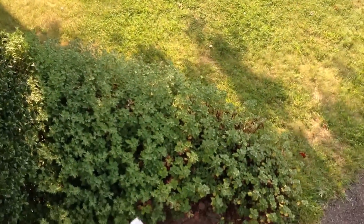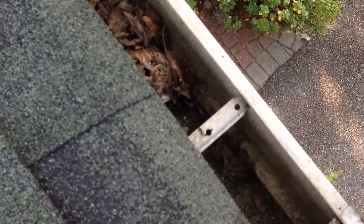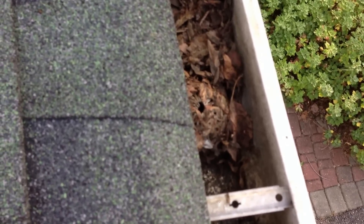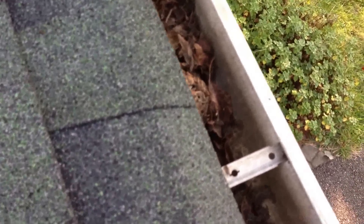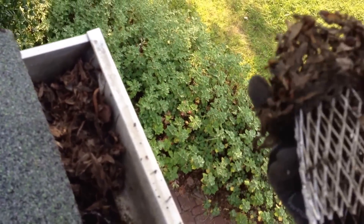I'm kind of suspecting a reason why it's failed. This thing doesn't even screw on, it just clips on, which is pretty nice. I can see why it's failed already — you can see all that debris. There's the downspout right there, and this is one of the biggest mistakes a homeowner makes. The gutter guard did a great job, but the problem is this thing right here.